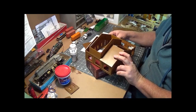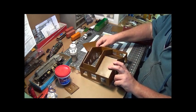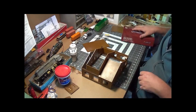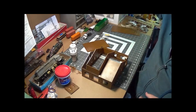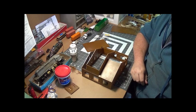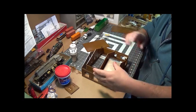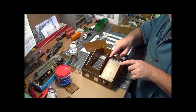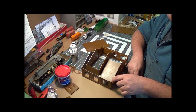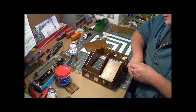A lot of people won't like the way I just did that. They'll say, oh, I did that backwards. Well, I kind of did, but not really. You see, there are no written rules on how you're supposed to model. What is written is that nothing is for sure. And what I mean by that is the racking of the building. Whereas it might be 4 1/8 inches up here, it might be 4 1/4 down here. And if it's off that far, it's going to be noticeable.